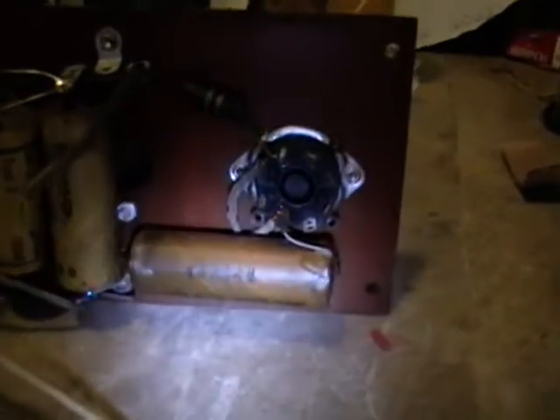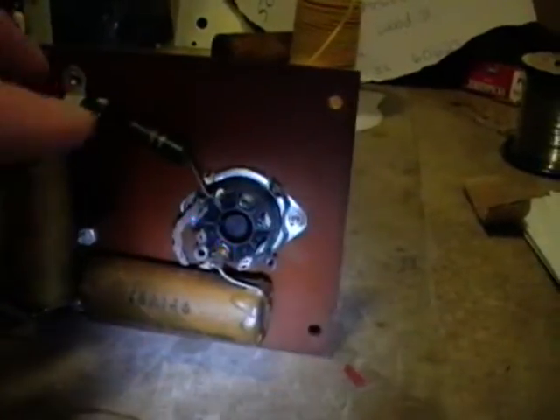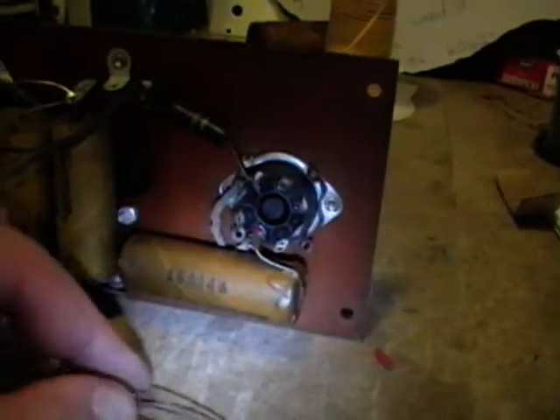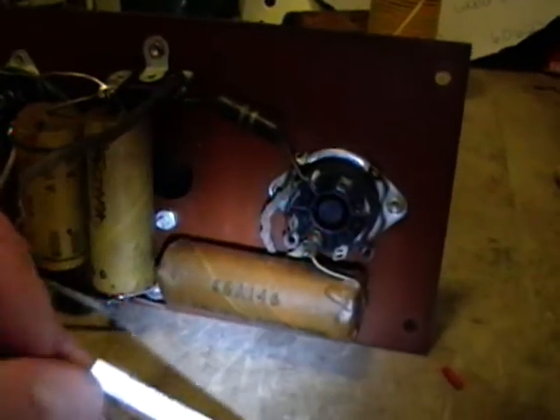The reason you need to take this out is because there are three big old capacitors down here that are quite often bad. Because this is going to be so inaccessible, I'm not going to bother rebuilding these. You can see how much smaller the new modern capacitors actually are — this is the one that replaces that guy. So just these three wax caps to replace, plus one or two resistors. That's about it — all that work just to replace three or four components.